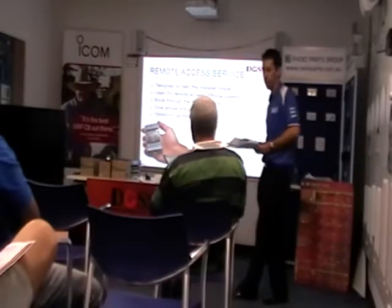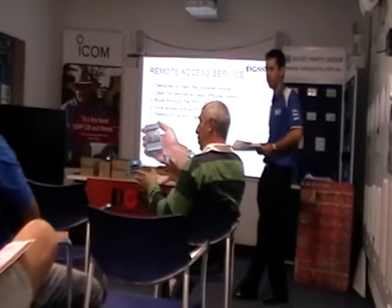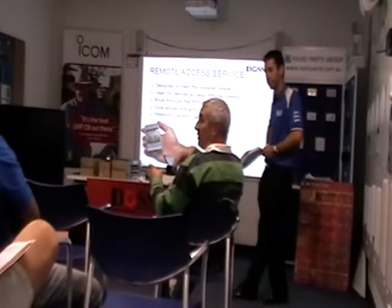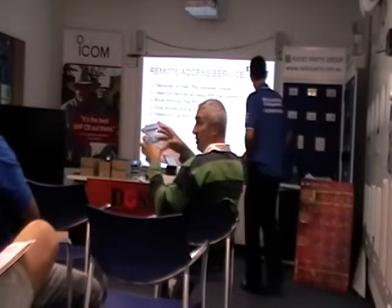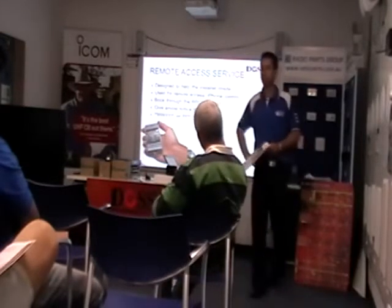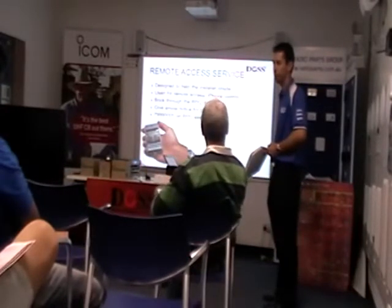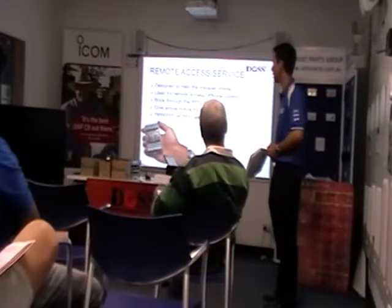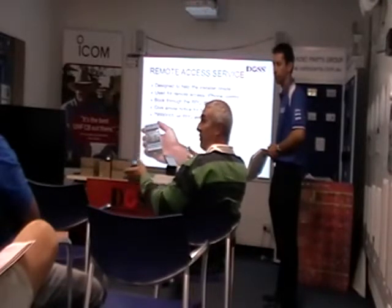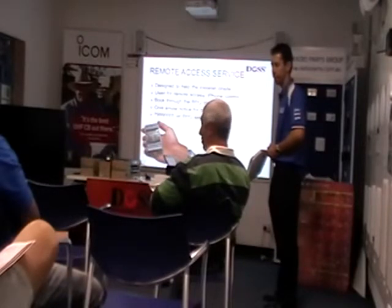Also, if it's a managed site, because some companies have their IT networking managed by another company, you have to get in contact with them to get them to tell you an IP address that you have to set your DVR to. You rely on them, and you have to get all that organised before you do anything else. Otherwise your DVR is going to conflict with another device's IP address on the network, and then the network crashes, and you'll be in all sorts of trouble.